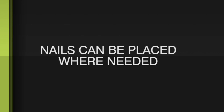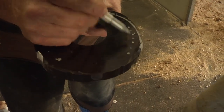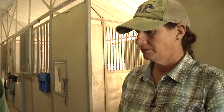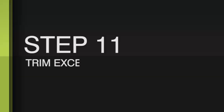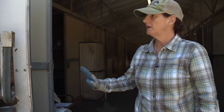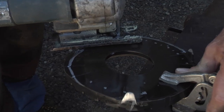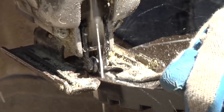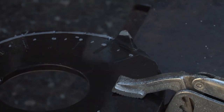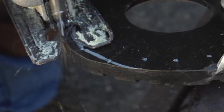The other thing that's good is if you run into an issue where you have a hoof wall that's blown apart — this entire shoe is an aluminum plate. So you can place the nail holes here, here, here, all the way back to here. There's an infinite number of places you could place it, and that's the important part — when I designed these shoes I had to have the ability to place the nails exactly where I wanted them every time. The next thing I'm going to do is trim off a little bit of the heel so there's less to grind. Obviously if you cut them too close you can't add it back — that's a farrier's rule.